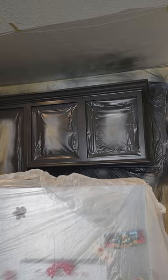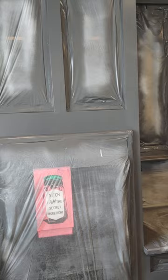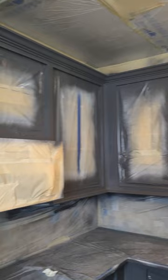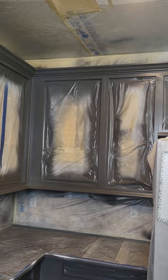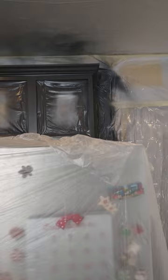This one was oak too — very heavy grained. When we're finished I'll post some photos. With the first coat of primer, which was the Centurion, we sprayed it and back-rolled it to get it into the grain. Then the second coat of primer — the Ecru — we cross-hatched it. It covered up the rest of the grain really really well. I'm impressed with this one.